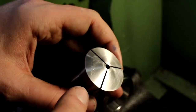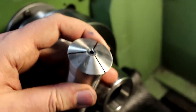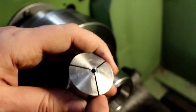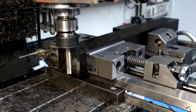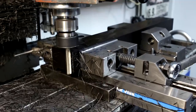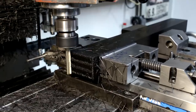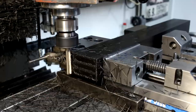I deburred the collet and I have a 3.8 mm gauge pin in here — the runout is in the 5 micron region, which is quite okay for a bored-out very cheap collet. It differs a little depending on which of the two pinions on the 5C collet chuck I use — the other one gets in the 10–12 micron range. I deburred with a die grinder, engraved '3.8 mm' on it, deburred all the slits, and cleaned it in the ultrasonic cleaner. I hope you enjoyed this quick excursion into thread repair and modifying collets. Thank you all for watching and subscribing — see you next time.